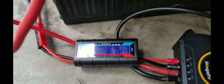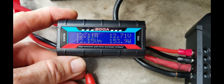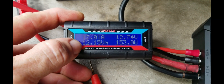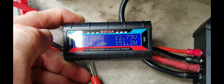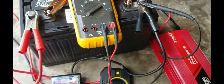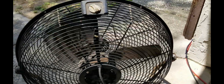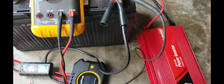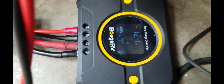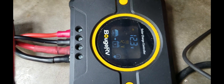Currently I'm getting about 155 watts off of those two 100-watt panels. I'm up to about 12 amps and 12.7 volts. The fan is off but the inverter is still switched on — let's switch the fan on high so we get that full 3 amps. And now at the controller we're at 11.6 amps and 12.3 volts.